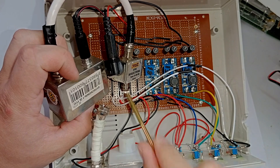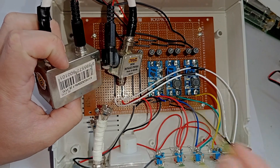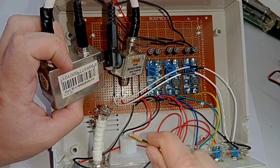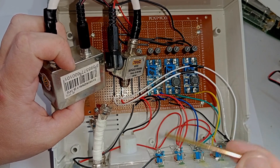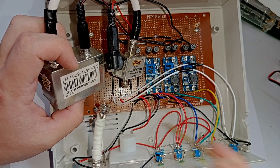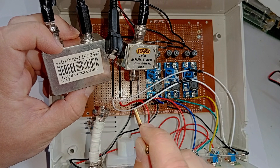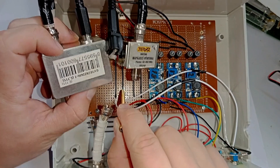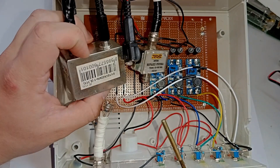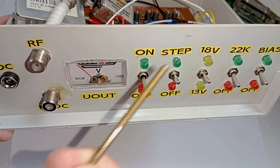That's why I want to rebuild this entire thing. That's kind of everything that there is to it. We have a voltmeter which is falling apart — it's extremely cheap. I added it just as an extra indication that we have some changing voltage on the output. Here it goes into the switch, this is the return path from the switch which goes into the BIAS-T, and this is monitoring the voltage before the switch. I just wanted an excuse to use these switches.